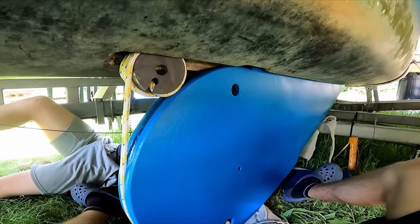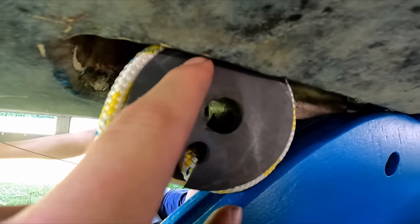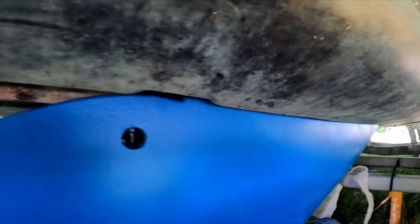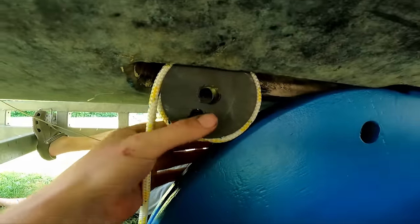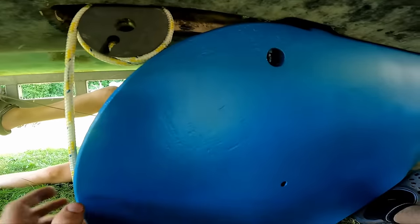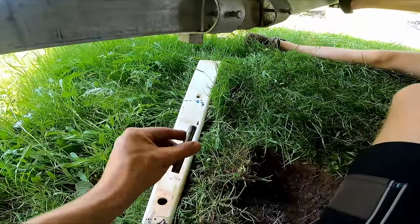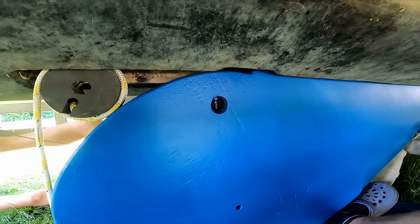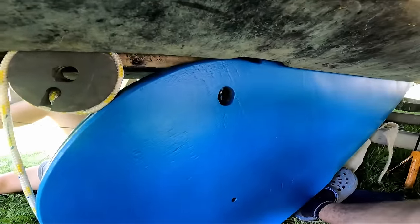The centreboard is slid in. I've wound this little drum here and there are holes in the top of it that line up - it has to be maybe a couple of inches of that end swung out, and then that should line up up top. Fingers crossed that happens. I've put a fresh line on it as well. We've got the pin and the boards that go in - don't lose that. I'm going to pop those in and slide it up, do a quick test fit, make sure it goes in, and then I'll get the sealant out and seal it.